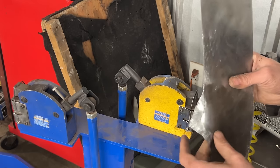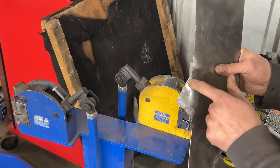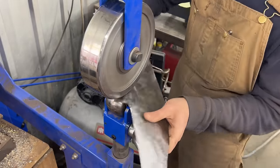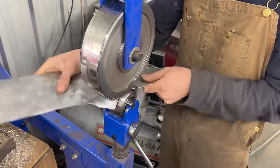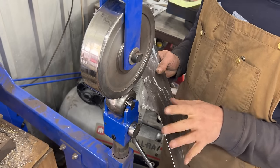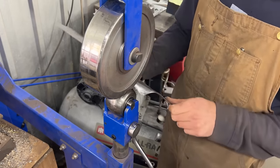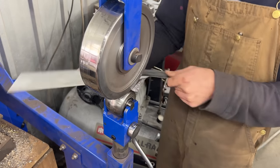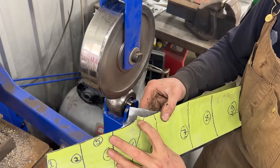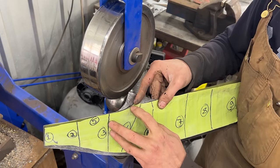So now let's go back on the English wheel and continue stretching this part, but now we don't need to worry about the sides. And for now, like I said, we don't care about the shapes that it takes. We're gonna give it the shape that we want after that, but it's already going where we want it. You see, it's pretty much taking that shape. Ooh, we're almost there. See, we have very little more wrinkles here and there.